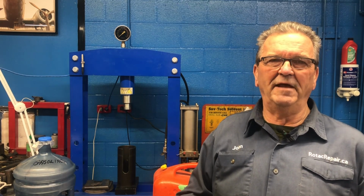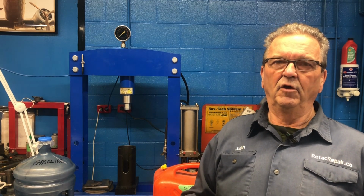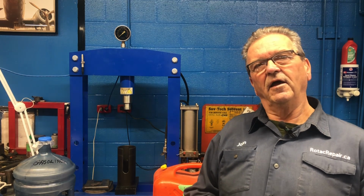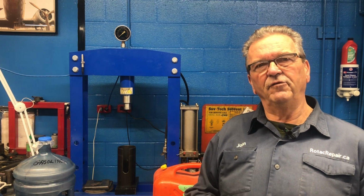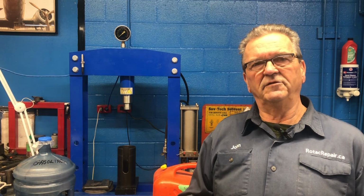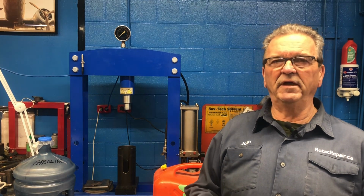Well, you couldn't go flying that day because the fuel system was contaminated. It's actually a good thing. It's a lot of work to clean it out, but it's what we need to do now that we have to deal with this E10, the ethanol in our automotive fuels that we use in our airplanes. It's just the world we live in now. That's just what we have to do. It's all the extra steps. So be it. Safety first.